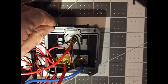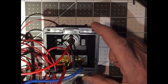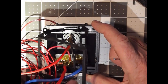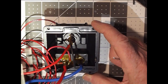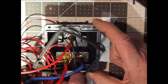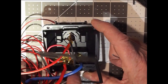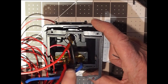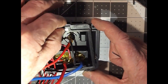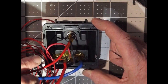So here's how I ended up configuring the wire harness for this end of the battery pack. And just a reminder that could save you some grief, don't forget to run the wires through your gasket before you do this, or you might end up like I did on the first pack I made. If you do end up and you don't want to unsolder everything, just cut the gasket in one spot and then wrap it around and it should be fine. At least it was on mine.